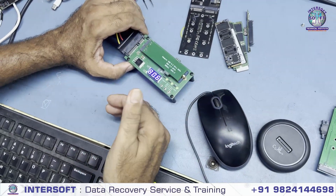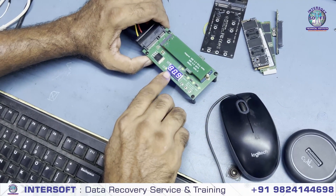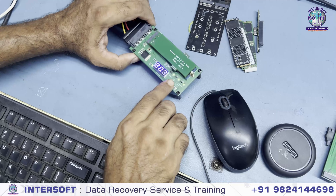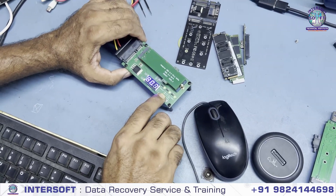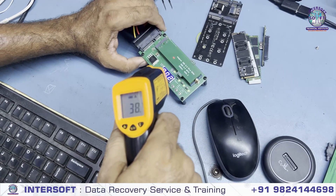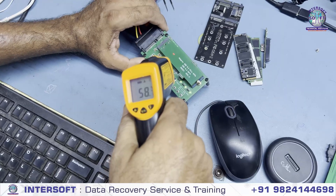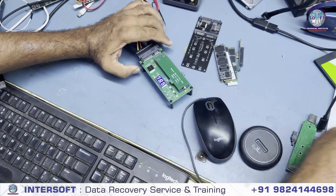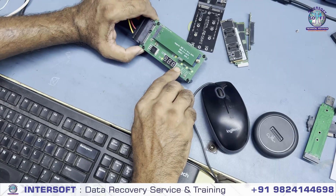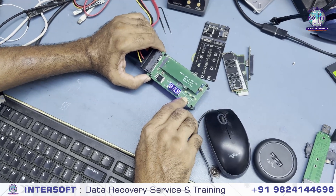This is only used for heating purpose. If data is not being copied, there are too many bad sectors due to dry solder, and the NAND is not reading properly — we can set the temperature. You can check now: total target temperature is 80.9, but currently it is 79°C — now it has reached up to 81. If you want to reduce the temperature, we set it here and reduce it. See the temperature is about 71 — sometimes it will go high. More than normal temperature — see 64. This is heating too much; it is too much heat. You can increase the temperature up to 120 also, depending on your chip. So this is for temperature control — we reduce it now to come back to normal temperature.